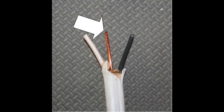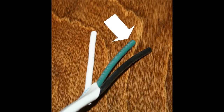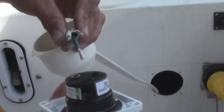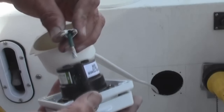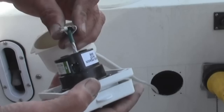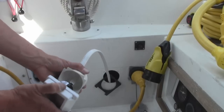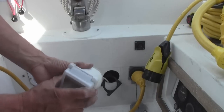It's important to use the correct type of wiring. Don't use a household-type solid electric wire — the ground is not shielded. Marine grade wire is stranded, it's tinned, and the ground is shielded. For this installation you want to use 10-gauge wire. Don't be tempted to solder the ends. On the back of the inlet is a wire trimming gauge so you know how much wire to expose, making it very easy to set up. The connections on the back are color-coded: green for green, white for white, black for black. Just insert them, tighten the screws down, and you're ready to go.